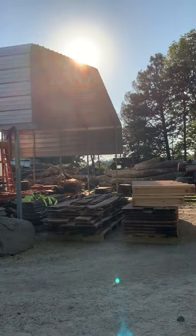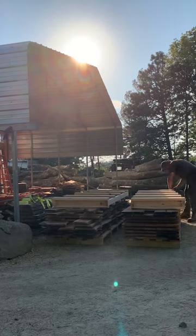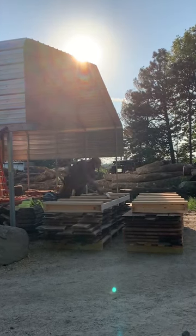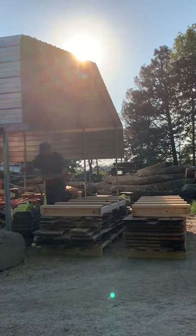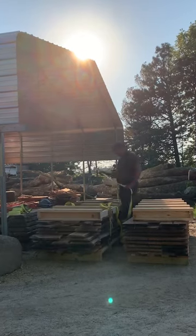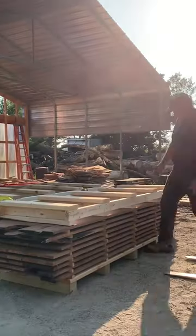Hey, hi, Glenn here, Workshop at the Gardens. We're putting the top part of the slab skids pallets on there — we call that the compression pallet, and that's what goes on top, as you can see. I use a couple of straps and tighten those down, and it compresses it all down. It helps a little bit with cupping during the air drying, but also makes it really nice and easy to move the slab skids around the log yard.